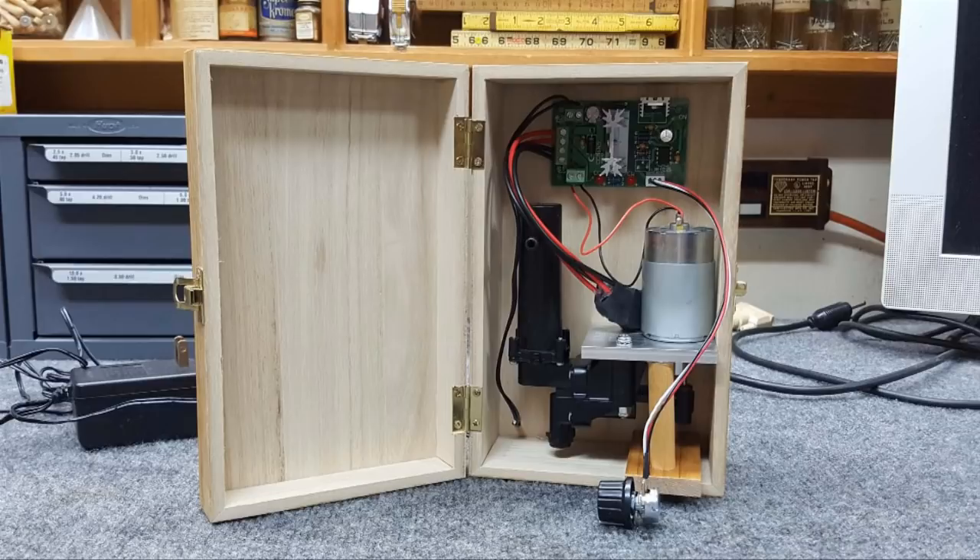When I get the air upgrade, I have to make my own pump — I had one but fried the first one. I had a spare PWM controller that didn't work well for the mill's power feed, so it went into this pump and works absolutely perfect. Now this air pump goes on either the mill when cutting aluminum to keep chips out of the way, or on the CNC 3018.